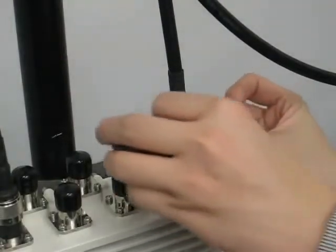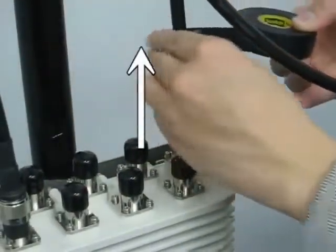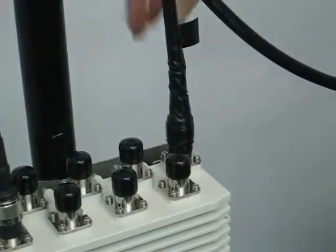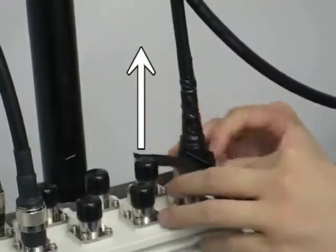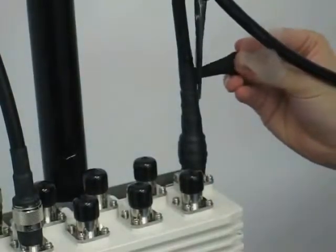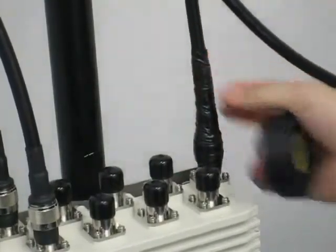After connecting one RF cable, you must wrap the RF cable with the sealing materials to ensure proper waterproofing. First, wrap the cable with electrical tape — this is to make removal of the waterproofing tape easier. Starting from the base of the RF port with one loop, overlap the tape to half width. The tape should cover the cable connector body and extend 25 mm above the connector clamping nut. Next, wrap the cable with the rubber tape in a similar fashion. Finish the wrap at 25 mm above the electrical tape, making sure the cable connector to the RF port junction is tightly sealed. Press the tape against the cable connector body and the RF port. Finally, wrap the cable again with electrical tape for UV protection until it is about 25 mm above the butyl rubber tape. Wrap the connector at the antenna end with three layers of tape in a similar manner.